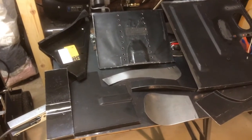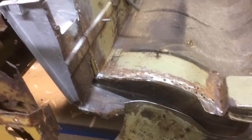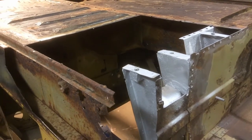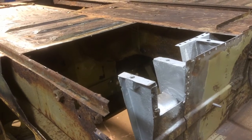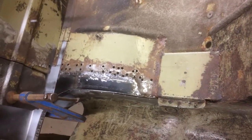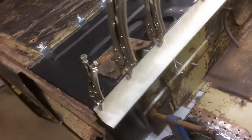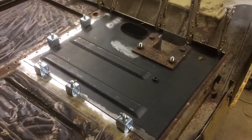I'll weld the small pieces in to the back of the wheel arch and make good that. Then when I've done that I'll fix the floor and the front of the bulkhead. The side of the wheel arch and the boot floor panels are now in, and I have put the rest of the panels in as a trial fit prior to welding them.